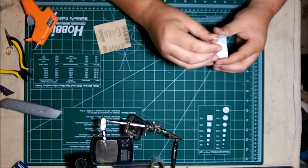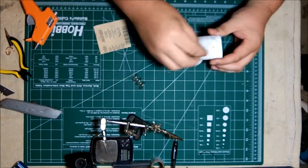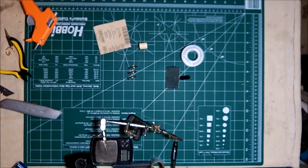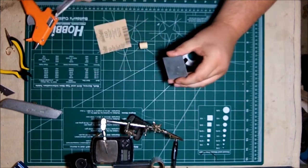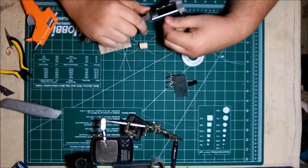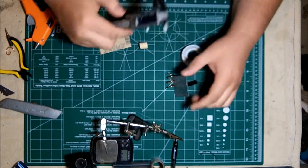I'm going to take my dowel rod plug, and I want to see about where I need to glue it onto the reflector. So I'm lining the coil up with the plug just to get an idea. From the base of the reflector to where the feed actually hits the coil, I've been using about 2.5 millimeters, and I've been having really good success with that measurement.